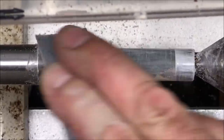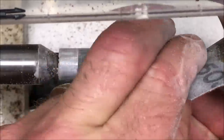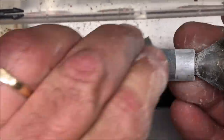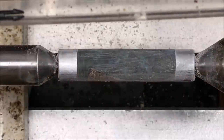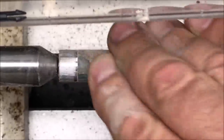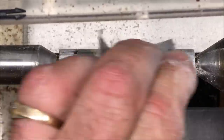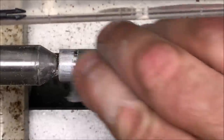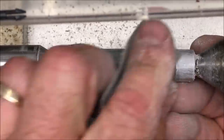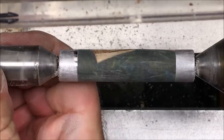I made one pass. Now I'm going to make a second pass just looking for the deep scratches, trying to get rid of them. You can see them starting to disappear as we make back and forth scratches. It's really bad right here at the end. Looking pretty good — there are a few here and there. As you wipe the blank off you'll find them. Keep working them until you eliminate as many as possible. Really watch down by your bushings because that's where you'll get those scratches, and they're a little harder to get out, but they are very noticeable in the finished blank.